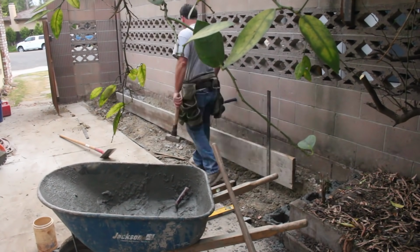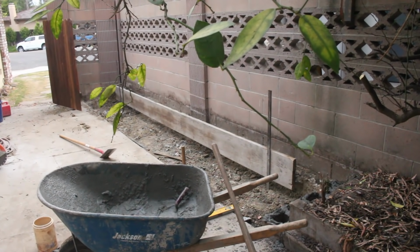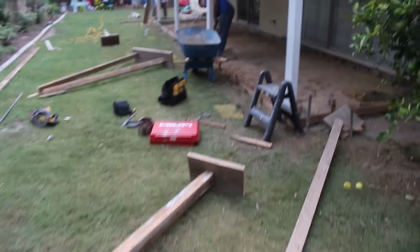And what I'm going to do also, before I pour the concrete over that footing, because I want it to bond to this footing in this particular case, because I really don't want it to start falling off the edge when I strip this while it's wet, so I can get a finish on it. So I'm going to put some glue. I'm going to clean that footing pretty good with the pressure hose. Then I'm going to put some Quikrete concrete glue on it, and then I'm going to put the concrete on that. That way it's going to bond to that footing.